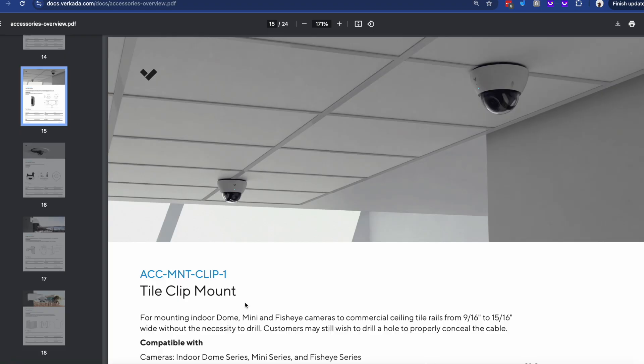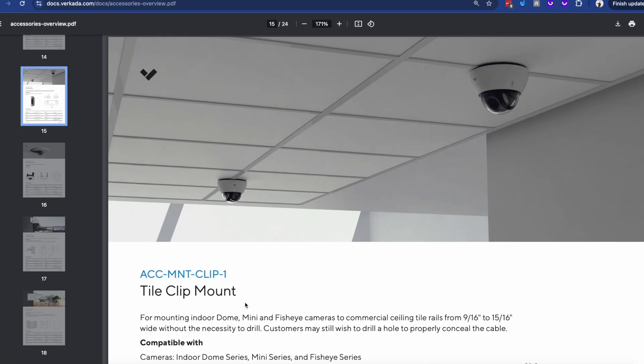Remember, pushing most of the camera within a ceiling means the troubleshooting LEDs are no longer visible. And talking about ceilings — specifically tiles on ceilings — back in the old days, installers had to devise clever things to hang cameras off them, including placing pieces of wood on the back and drilling cameras through the particular ceiling tile. However, now we also have tile mounting clips that allow you to hang these cameras by using the rails in between those tiles.